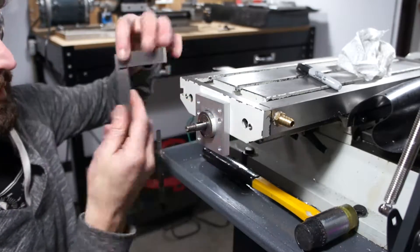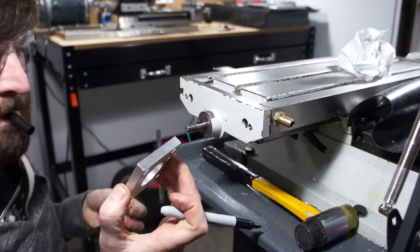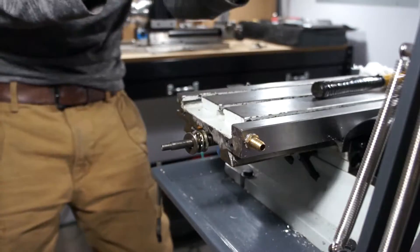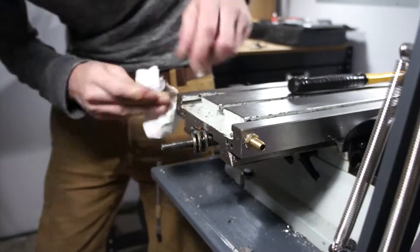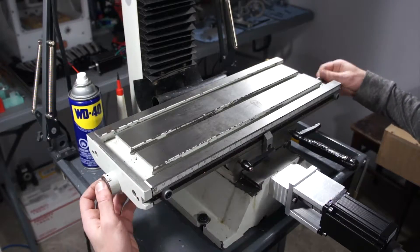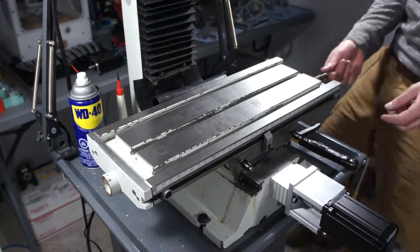The next step is taking this little end plate off. I knew I was going to have to drill it and tap it for some mounting locations for the stepper mounting plate, so I just marked them right now and that way when I have it off the mill I can drill and tap it. I knocked it off with a hammer — there are some guide pins that basically keep everything aligned and a thrust bearing that takes up the thrust for the lead screw. So we'll take that off this side and then go about removing the lead screw.